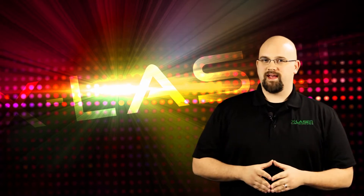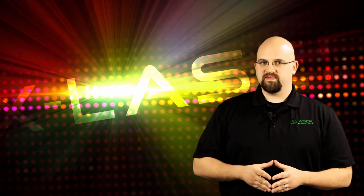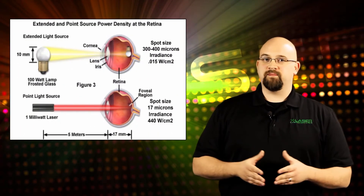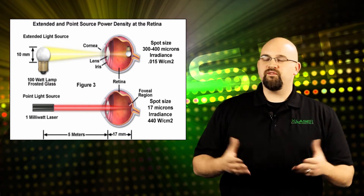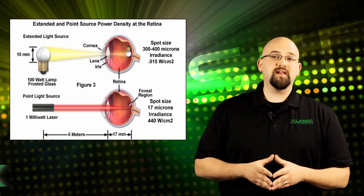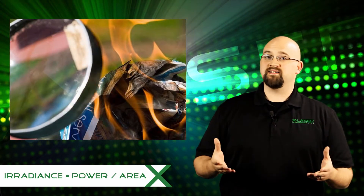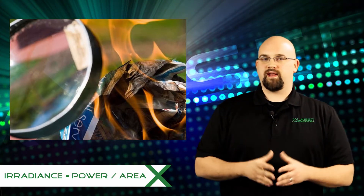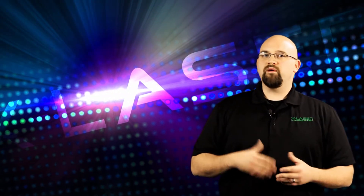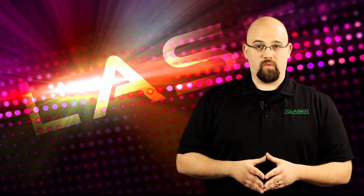So what is audience scanning? Audience scanning occurs when a designer or laserist intentionally directs laser beams into audience areas. Normally high-powered lasers need to be kept up above people's heads because the human eye is capable of focusing laser light much more efficiently than other kinds of light such as sunlight. Better focusing leads to higher levels of irradiance, and just like holding a magnifying glass under the sun, when you can focus energy down to a tiny spot, high levels of irradiance can cause damage. In audience scanning we're employing a series of techniques to very precisely and reliably reduce the irradiance of lasers, keeping the show eye-safe and comfortable to watch.